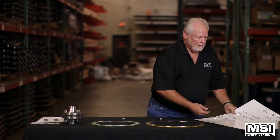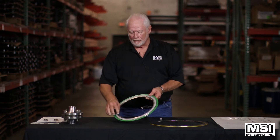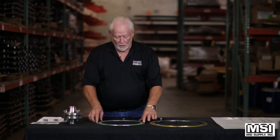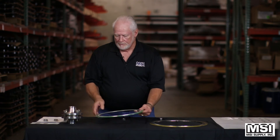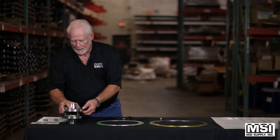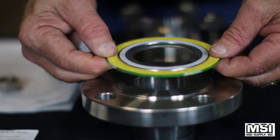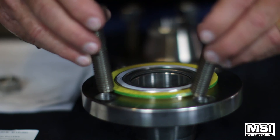Some people ask for a guide ring or gauge ring. A lot of people think it may be the inner ring — that's not true. The reason they call it a guide ring or gauge ring is because this ring sets inside on the flange between the bolts; it lines the bolts up so it's centered. I have a small one here on this flange to show you that it's between the bolts and that lines it up so that it doesn't get off to the side.